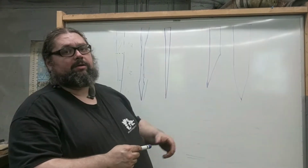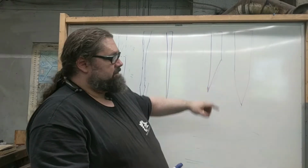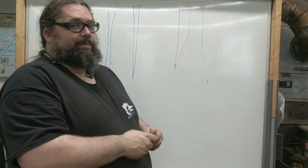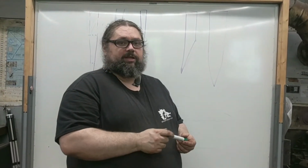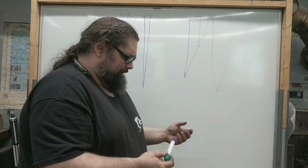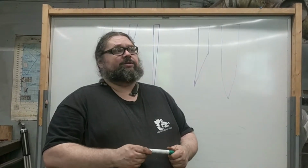These are some designs you see commonly. This is what would be on a Yanagiba or some of the other Japanese knives. These are directional cuts, so these are only designed to cut in one direction, and they're not a universal cutting edge. In the case of a Yanagiba, you're cutting fish towards you, this side toward the fish, this side up, and it cuts a very thin, even slice. And they're great for that, but they're bloody useless for everything else. The other thing you'll see a lot is like on a Deba or on a European style cleaver, you'll see something that's basically parallel with the radius edge, maybe a third or quarter up the knife. And they suck for everything except acting as a cleaver. In the case of a Deba, it's for chopping down big pieces of fish, but in the case of a European cleaver, it's for just chopping whatever you have. And they work great for that. What they don't work great for is anything else.